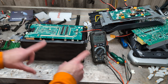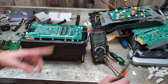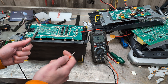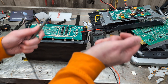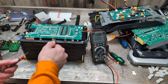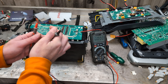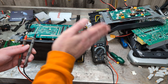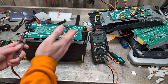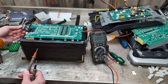I'm going to give you some voltage readings and then I'll flip over and let you see the cell arrangement, hopefully. I was looking for a BMS and some people suggested DALYs and other things like that. The way I see it, if this is 16 cells in series, then we need a 16 series BMS, and there are 16 individual wires for the positive sides of each one of the batteries — and there are 16 wires up here.